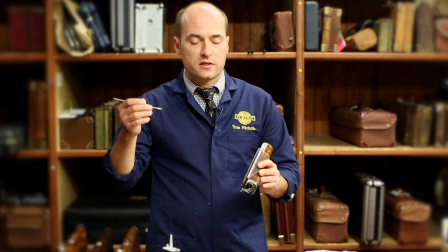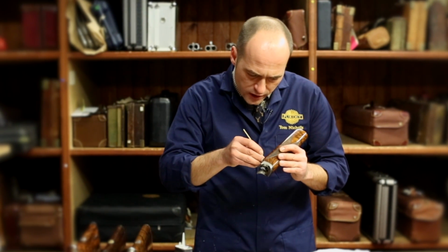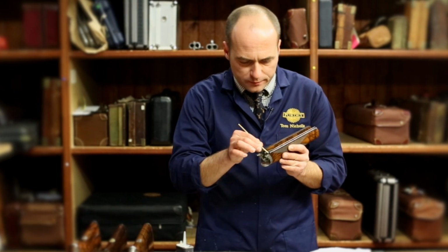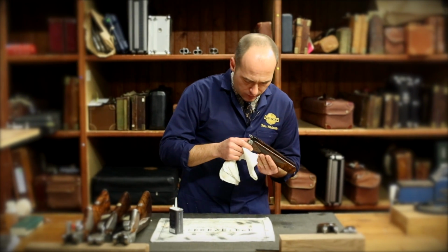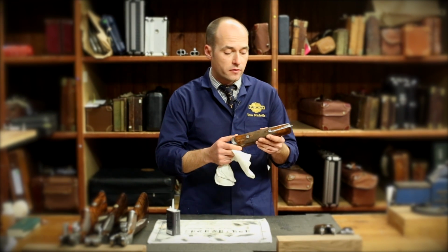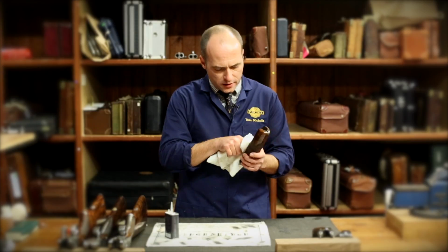I recommend for this, anything you see going on in there is the cotton bud, so a nice clean cotton bud yet again. And without disrupting any of the mechanism, just really in there, cleaning, drying and removing anything that has built up. Again, at this stage, like the mechanism and the visual check on the outside, I'm going to look over the mechanism in there, make sure there's nothing obviously broken, nothing hanging out, nothing loose, nothing doing something it shouldn't be doing. Checking the pins to make sure everything's still up and square. Checking the fore end push rod for free movement. And just having a good wipe down again of the metalwork with my rag.